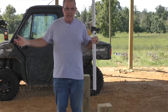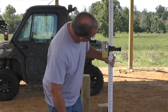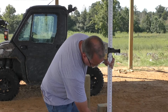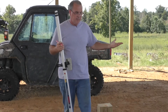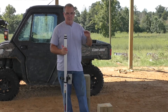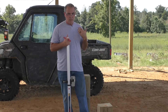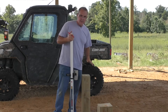Now we've got it set — go to the next post, mark it, go on to the next post. You've got 15 of them. Now we've made 15 marks on 15 posts that are laser level. Our beams will sit on them, frame it on top, deck it on top — guaranteed to be what you asked for. In my case, 37 inches above this spot.